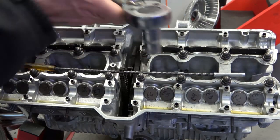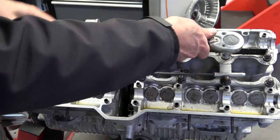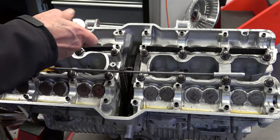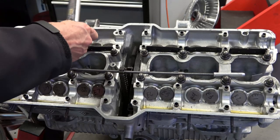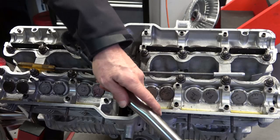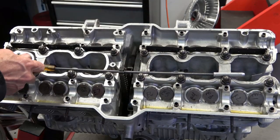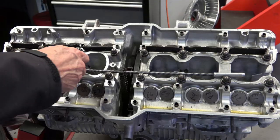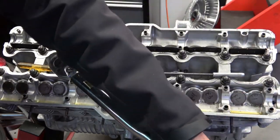What I do is turn the cap without worrying about torque at first — you just keep turning until you feel a little bit of resistance. Don't fully tighten it; just bring it down to where you feel resistance on the wrench before you start torquing to spec.